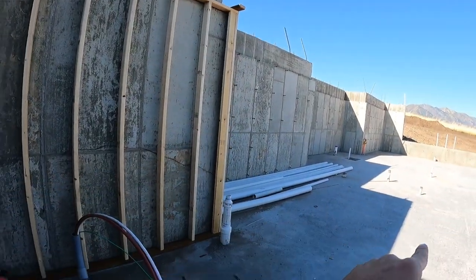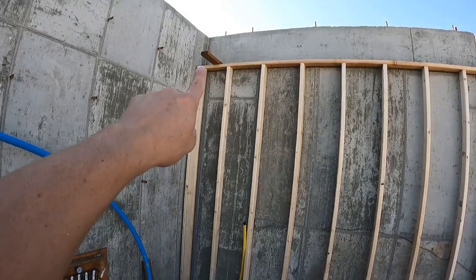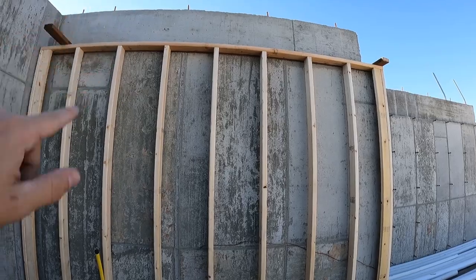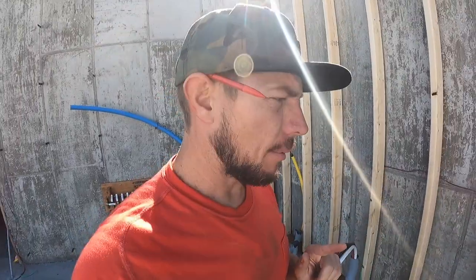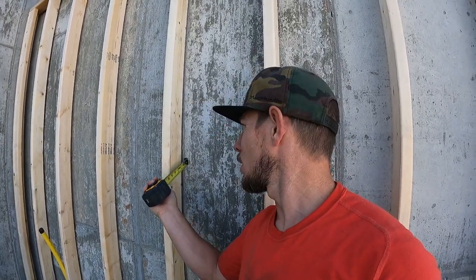The wall will come out from here, and obviously a wall comes out from here and runs along for all of this. I've gone ahead and set a nailer up there and a nailer up there. That way once we put all the trusses in, I can just nail directly up. We'll put some anchors in the bottom and this thing's not going anywhere. We're ready to start setting our electrical panel in here, which is the main reason I wanted this wall set first.